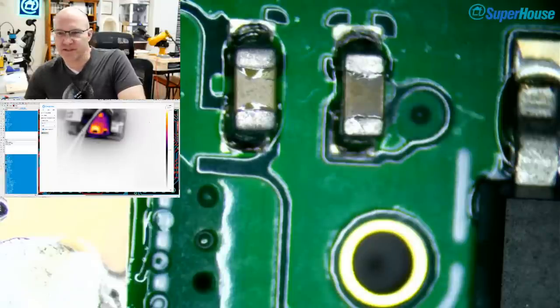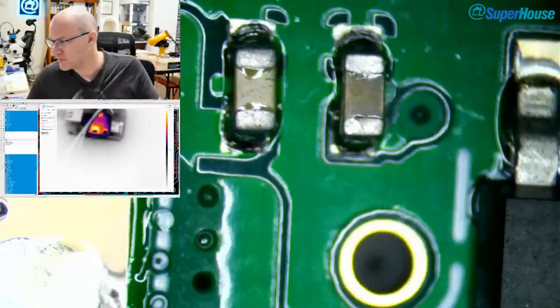I'm really over time now. I thought that we'd have this all up and running and then I'd have done the tests on it by this point, but we didn't get that far, not in this live stream anyway. But it is running, it's running blink now when I power it up from the external supply without the onboard voltage regulator. So I'm fairly confident that if I stick another regulator on to it, and not that super dodgy tarnished one that I'd pulled off a busted board, it could have been busted in the first place.